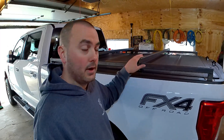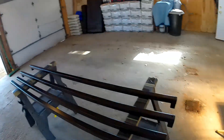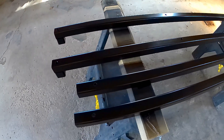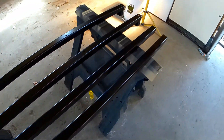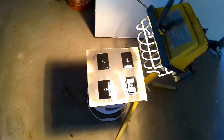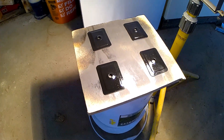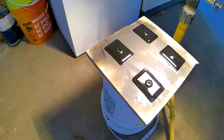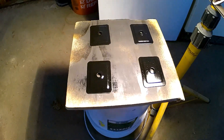We're on the next day or two here getting some of my painting done — there are the rails. I used a semi-gloss black; I cleaned and prepped all the metal before painting. I also decided to do the caps and get them drying under the lamp. The stake pocket tie-down caps that were chrome I painted semi-gloss black to match as well, so hopefully it'll all look good — blacked out on the truck. Now I just have to wait for it to dry and put it all together.